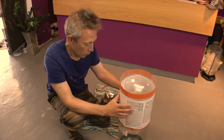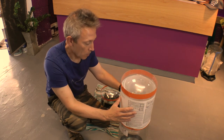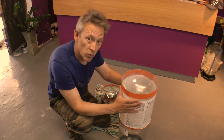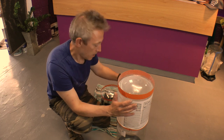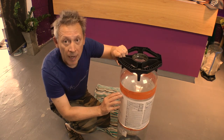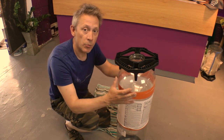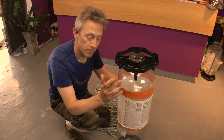The reason I built this so tall is to simplify demonstrating the task, but also a container this big would be quite hard to move around. Obviously if you shorten it there's less volume of water and it'd be quite easy to pick up. With this inner lid turned upside down it becomes quite rigid. The optional extra — and this is why I created the lip on the outside — is to put the outer section back on, rivet it in with retaining studs so we can easily lift it by the key keg handles instead of flexing the key keg itself.